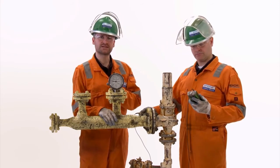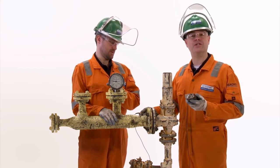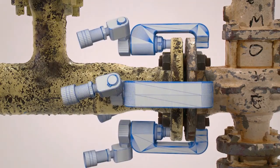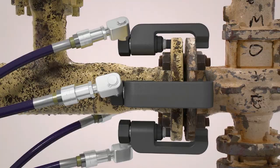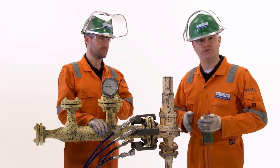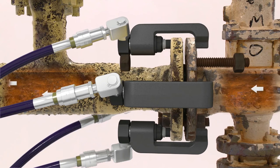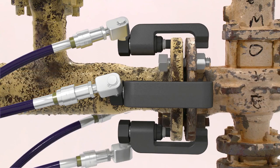Prototypes were developed and tested extensively in the harsh North Sea environment. The ultrasonic bolt load monitor first assesses the datum length of each bolt. Four hot bolt clamps are placed around the connection, adjusted, and an even hydraulic compression applied. During load application by the clamps, the offload of each individual bolt is recorded. The bolts are then individually replaced and tightened to replicate the original bolt extension. Hydraulic pressure is then gradually released to precisely reinstate the connection to its original state.